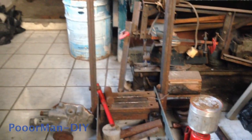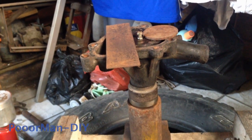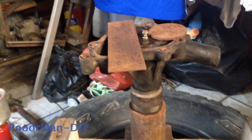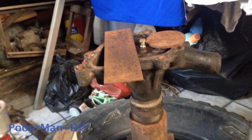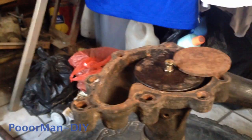If you don't have a press machine like this, I think we can use a more simple way — a more simple tool. We can use the hammering method. You can use a hammer to press the center shaft out.